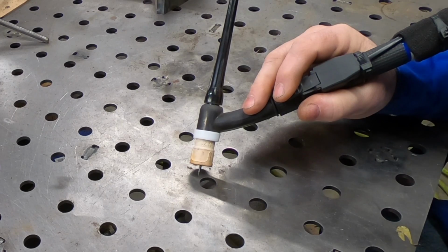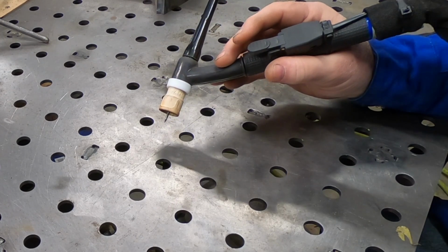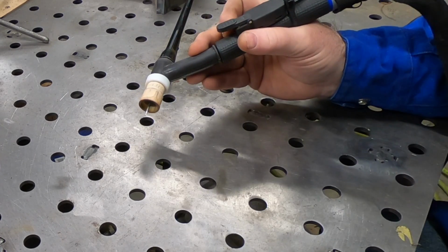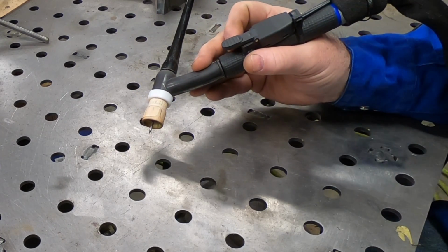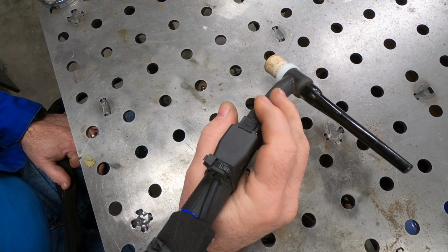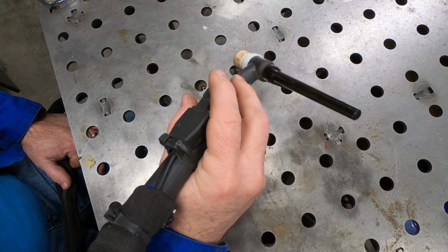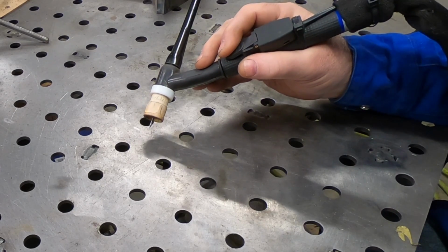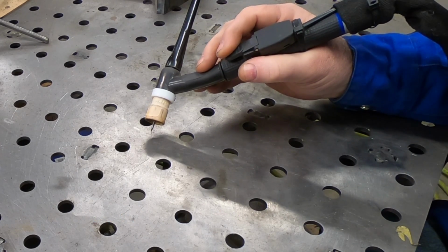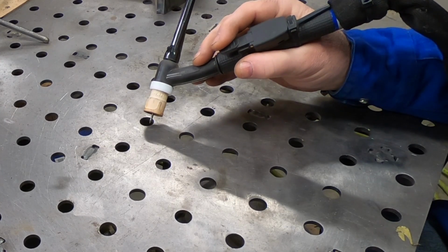I've also done a video that explains how this works with my PrimeWeld TIG225 AC/DC TIG welder. There's essentially two modes, 2T and 4T. The 4T mode being the more complicated one to set up and dial in correctly. There are several different knobs on the torch that set the base current, upslope time, downslope time, and ending current, as well as the welding current.